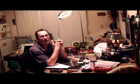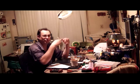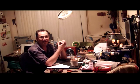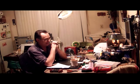I soldered a lot for a long time. I was talking with a plumber once and he asked if I was using flux. I said no. He said, 'What? You're not using flux?' So I brought my iron over, tried it with flux, and it was like — holy cow, he's right. Since then I've been using Harvey's Plumber's Flux. It's a dollar nine for a big tub of it at Home Depot. You can get electronics flux, which is like eight bucks for the same amount. I'm going back to Harvey's — I bought one of the electronic ones and I cannot tell a difference.